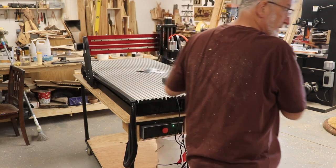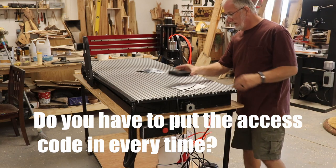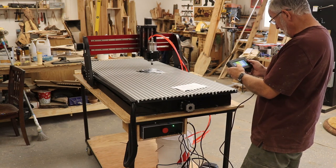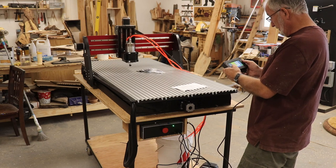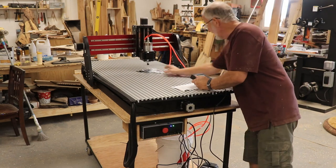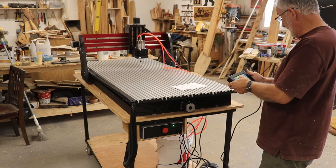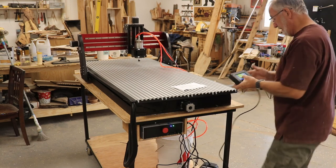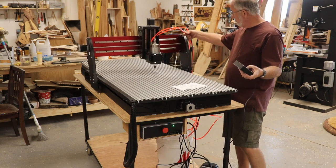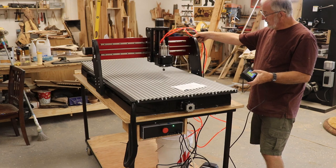I'm going to move the fourth axis here. Do you have to put the access code in every time? I hope not — I hope it's a one-time thing. Right and left works on the X-axis, which is across. Since I've been using the unit for a couple of weeks, I've discovered that the water lines and the cables hang down and get caught on clamps, so I've rigged up the lines along the gantry to keep them up off the table.